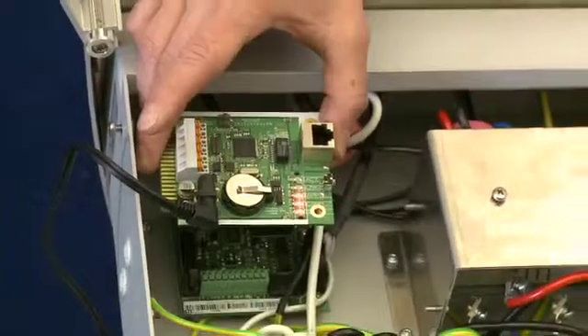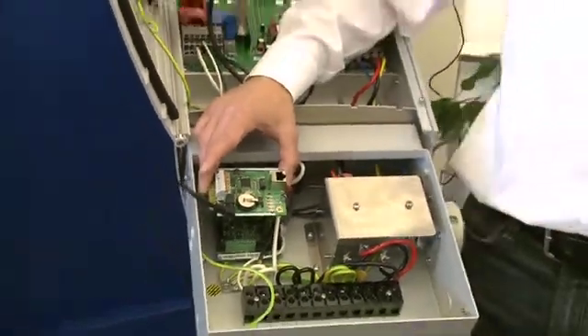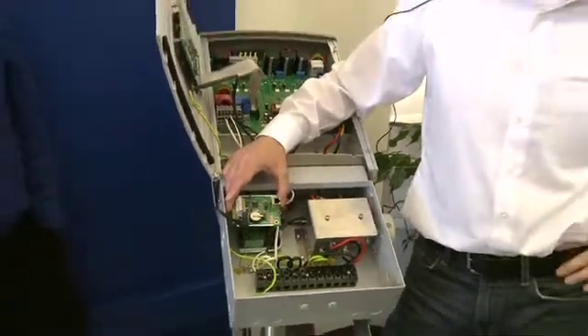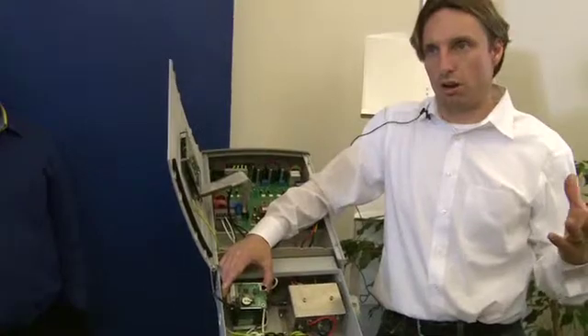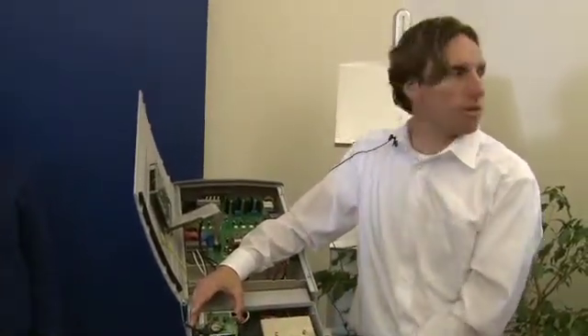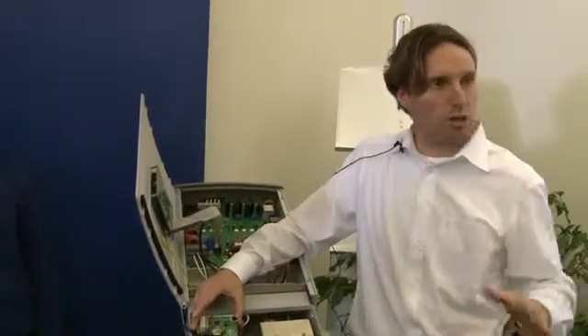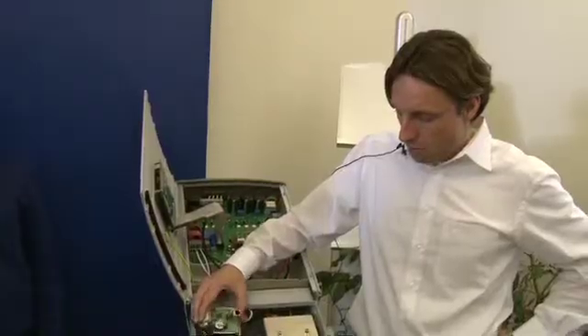It takes a little bit of time to scan. In all cases, it's very good to wear gloves when you install the card, because you need to statically discharge yourself. When you are statically charged and you touch the card, you could damage the software as well. So touch the metal, touch ground, make sure that you have no static on you, and then install the card.